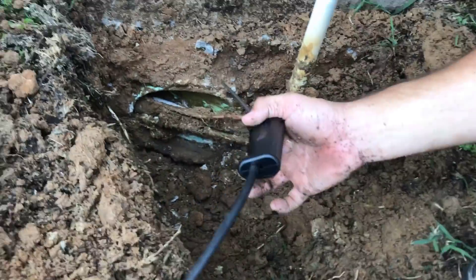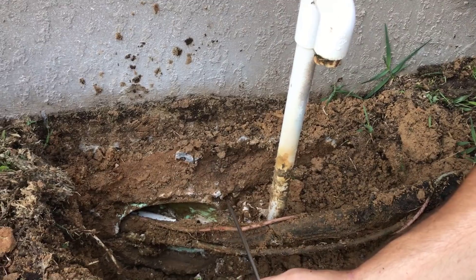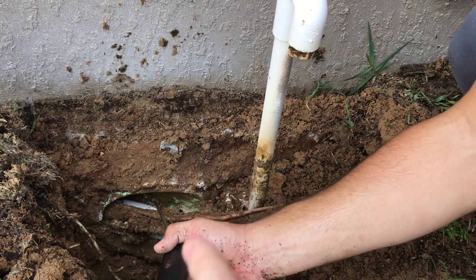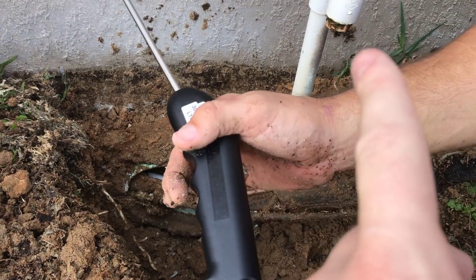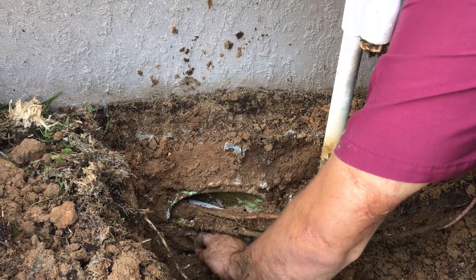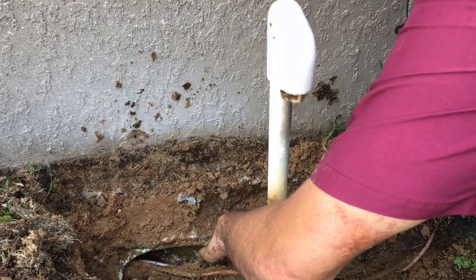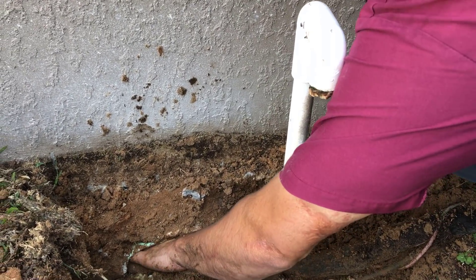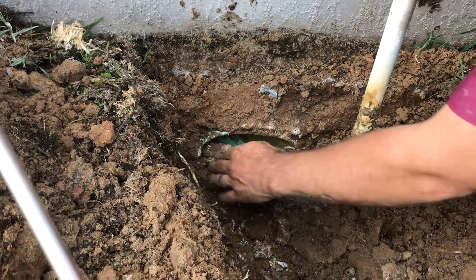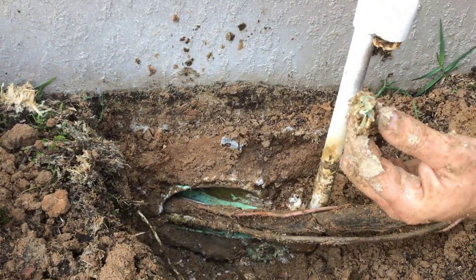One thing I want to mention is that this is the problem with bleach. The problem isn't just what comes out of the end of the drain pipe and drips — it's that if you have a chase application, it can backfill the chase, which is very likely with the way this chase was sealed. Also, if this drain has a small leak or a fitting that's not glued well inside that chase, it can actually fill up that chase with bleach water, which over time will just eat that copper away — and that is something we do see.